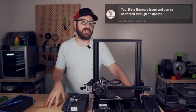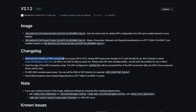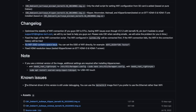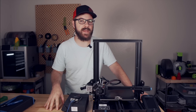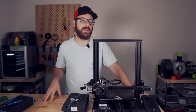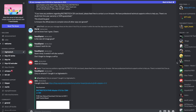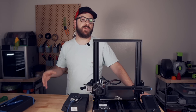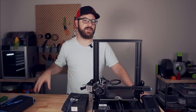When I first contacted Bigtree Tech, they believed it was just an issue with the OS that could easily be corrected with an update. So on September 1st, Bigtree Tech released a new version of their OS specifically for users with Wi-Fi issues. At release, this version is known to break the Ethernet driver, and it's only recommended to update to this version if you're planning on using Wi-Fi and having issues. They did state that their goal is to have a version of the OS that works fine with both Wi-Fi and Ethernet as soon as possible. With this release, it did seem to solve some of the Wi-Fi issues, but it did not correct all of them. The CB1 I ordered directly off of AliExpress still did not play nicely, even with this latest version of the OS.